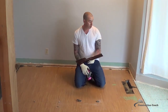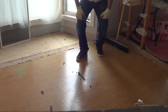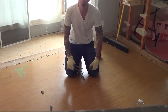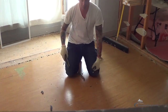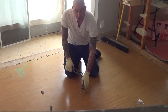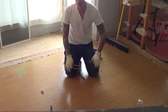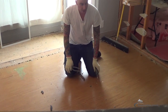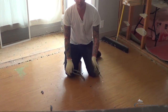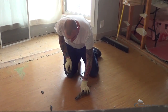You really need to make sure what you're doing when doing renovations like this. I've got all the cushion, carpet, and smooth edge off around the perimeter. Now you're left with the final task, which is to remove these staples. They use staples to attach the under cushion down, and before you can start with any new floor — and for safety — you should get them all out. There are a couple of methods: pulling them out with pliers one at a time, or using a screwdriver and getting underneath them.